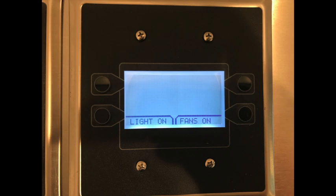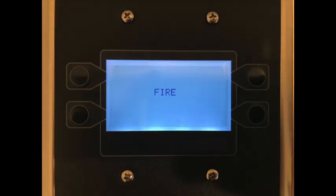Almost all of the faults covered by this video occur when the control package is first powered up. The first is not a fault at all, but the HMI will say fire and you will have no control. This means the control package is in fire mode and is either not wired to the hood fire system, not wired correctly, or the hood fire system is not in the armed position. Watch the other video titled Fire System Microswitch Wiring for more information.